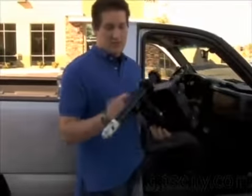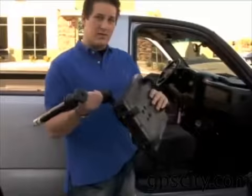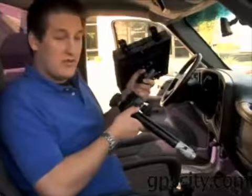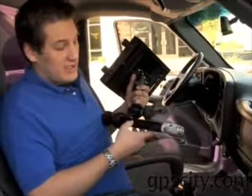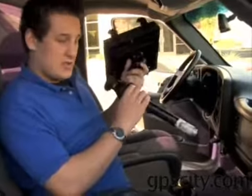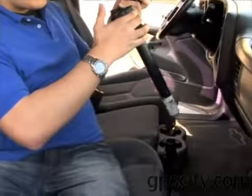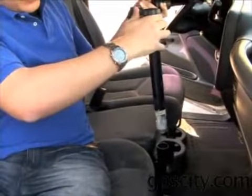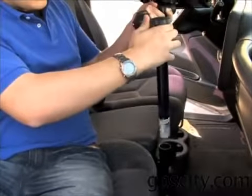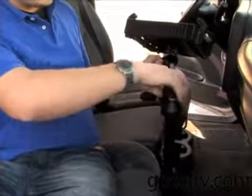The next step is to install the upper telepole assembly, the swing arm assembly, and the laptop tray. When installing the upper telepole into the lower telepole, it is recommended that the wedge castings at the bottom are greased on the inside and the outside. The lower telepole should also be installed on the base prior to inserting it. Once it is greased up and the lower telepole is in place, you can insert the upper telepole, put it to your desired height, and tighten the knob.